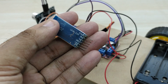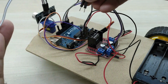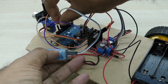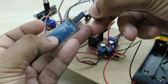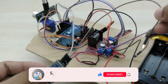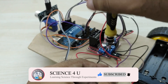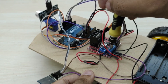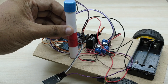It is now time to connect the HC-05 Bluetooth module. Connect the transmitter pin of the Bluetooth module to pin number 11 of the Arduino, and the receiver pin to pin number 12 of the Arduino board. Connect the power and ground pins of the Bluetooth module to the positive and negative terminals of the battery, since all the +5V and ground pins on the Arduino board are already connected. Now stick a plastic tube as an antenna and place the Bluetooth module in it for better signal reception.